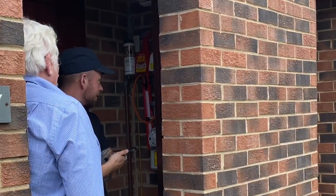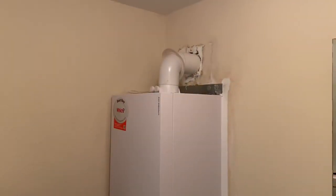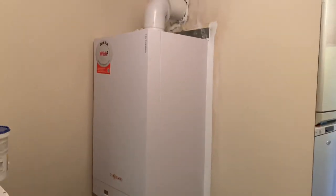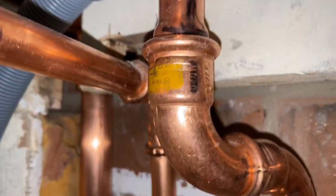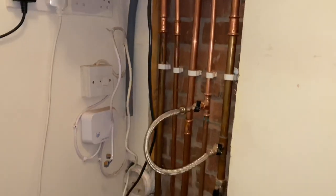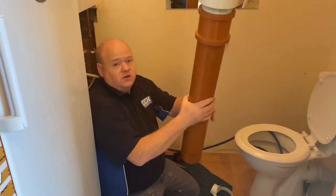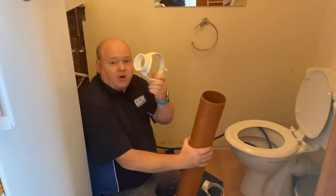Danny's got the assessor assessing him now. Danny's installed the flue and I've checked it as well. It's been sealed and we've just plastered the side of the boiler as well. These press fittings - the gas ones have like a yellow label on them, sometimes this wears off, so it's just something to be aware of. I've marked that wee pipe and I'm going to put this strap-on boss on.